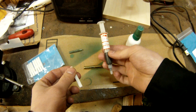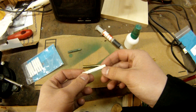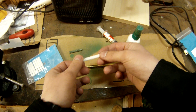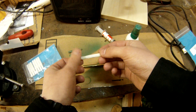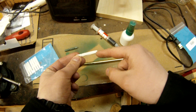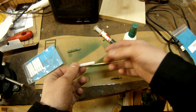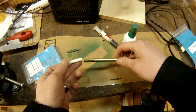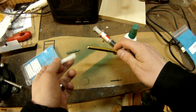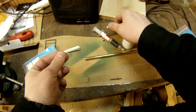It's good to start out with a nice coarse compound when doing this. This is some super cheap 40 micron diamond in oil. It's also important to use cutting fluid when you do this, because now you're using a power tool. The idea is you use a power tool and you want it to be spinning in this direction — that way you're actually pushing the cutting compound ahead and up onto the cutting surfaces. Now, while it doesn't look like it, this is actually subtly tapered along its length, so you can't just ram it all the way in. You've got to work it in slowly, and again, you're using a power tool so you've got to be careful, because you can apply a lot of force with a power tool, and you can create a lot of heat as well.